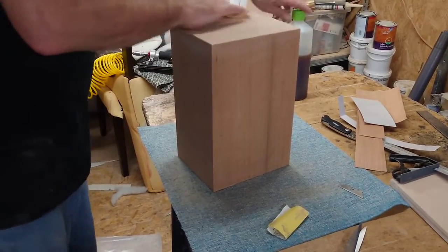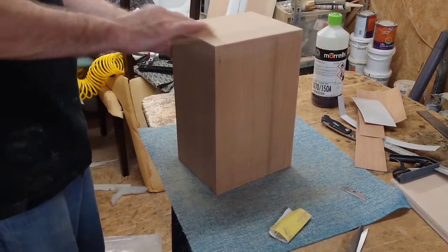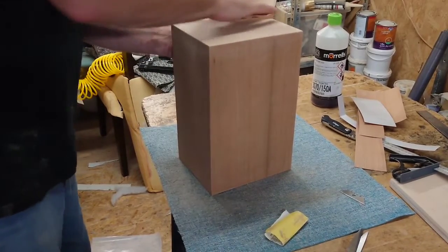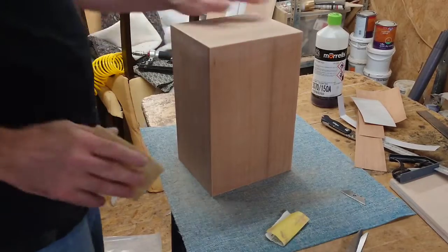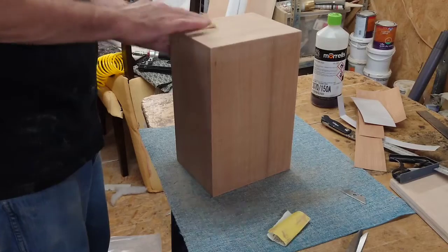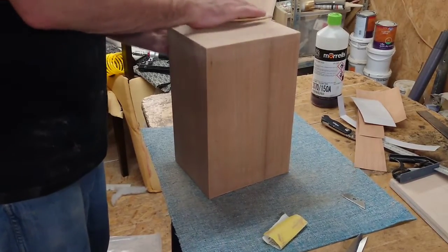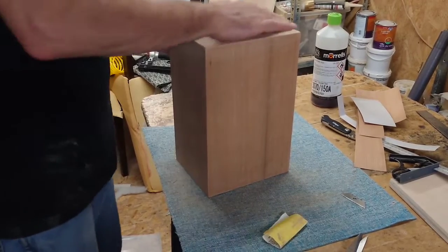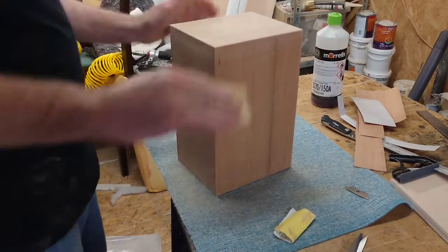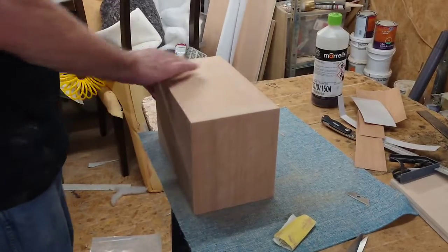With this sort of polish, you don't have sealers, all you use is that polish on its own. This is a great polish to do work like this. It's not a traditional French polish, it's a polish where it's got resins dissolved in alcohol along with a little bit of shellac, but it makes it hard wearing and heat resistant. And that's what we want really. So I use that on people's tables.